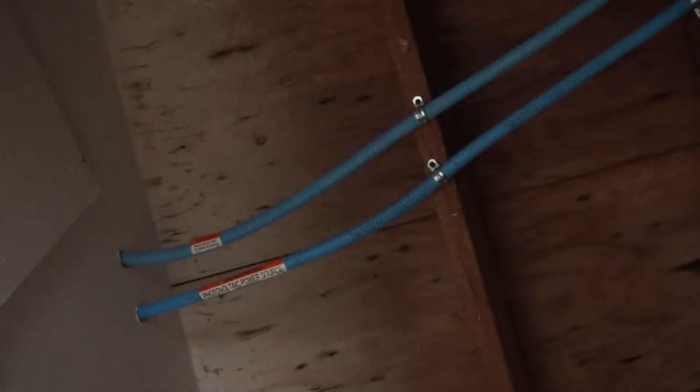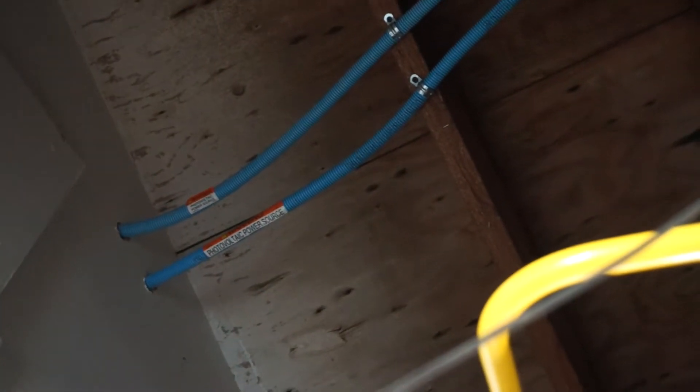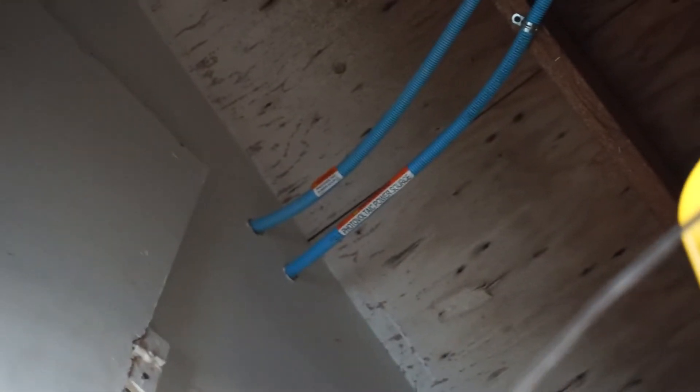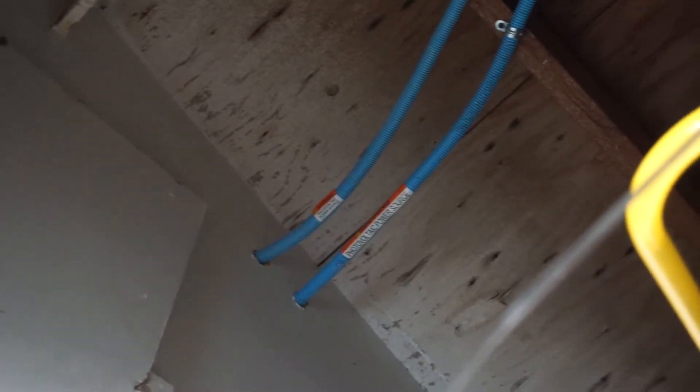You can't really see the bottom of the solodeck from here, but you can see the blue. I actually ended up using Smurf Tube. It's connecting into the solodeck and running up in that direction. You can see the Smurf Tube goes through some holes I made in the drywall here in the garage and then goes directly into the attic. The one on the right combines up with the panels in the main portion of my roof in the front. The other one takes a left turn, goes into a junction box, combines with another string, and goes down into the combiner box.